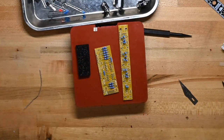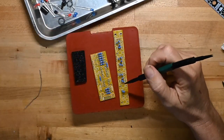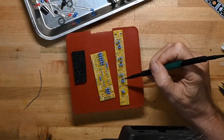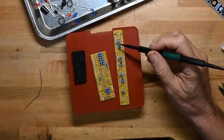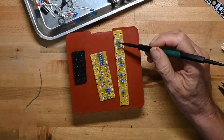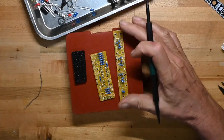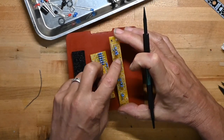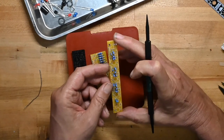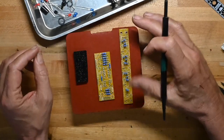And that's the end of resistor time for this kit. And on the pots and knobs board, these are all stand-up resistors. And if you're trying to figure out how things get laid out, they're all symmetrical. All the resistors of the same value go in the same positions. Same with the transistors that'll go on them and the LEDs. So that's that for resistors.